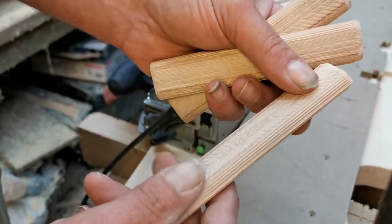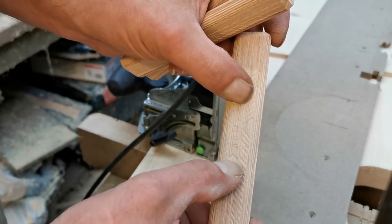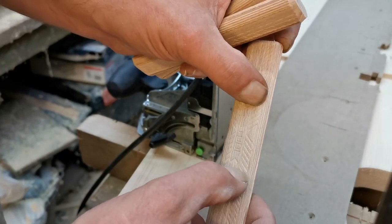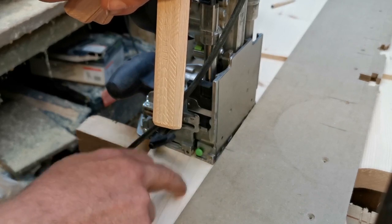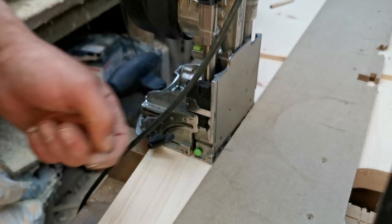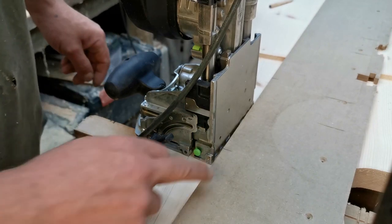Right, the dominoes I've got are half inch, 140mm. I'm going to cut them down into 3, so I should get just over, well, they're 135mm actually. I should get just over 40mm. So I've set my cutter to go into here, 30mm timber, 25mm into there, and then I should get another 20, 25 into the other, into the back. I've got my pencil marks here.